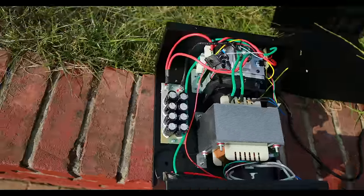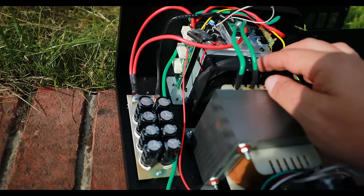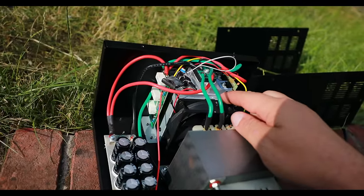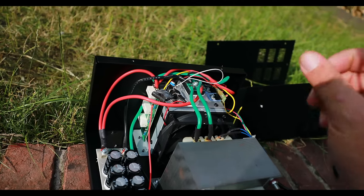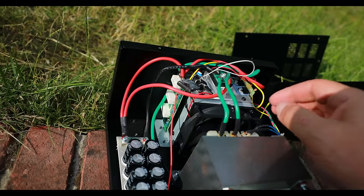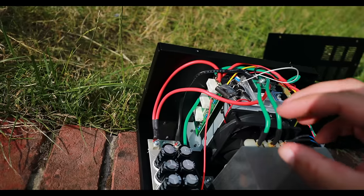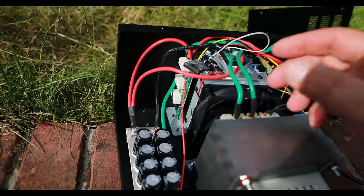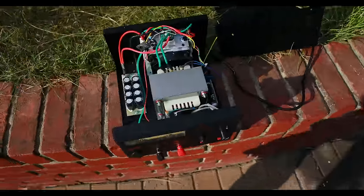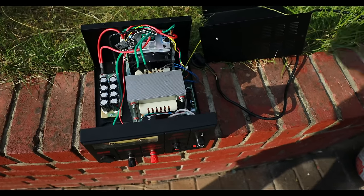The issue is everything gets hot inside. When the thermal switch is off, the fan is not spinning at all, so everything gets hot — including the transformer. There's no temperature sensor on the transformer, only on the heat sink where the rectifier bridge is. When it gets really hot, the fan starts at full speed, then stops when things cool down. That thermal cycling — cold, hot, cold, hot — is actually killing the components, just like with TVs.